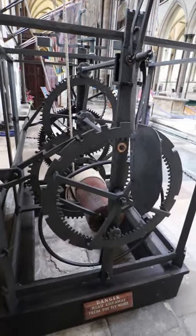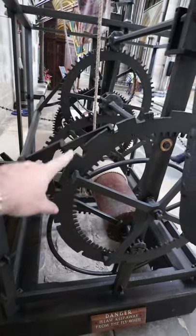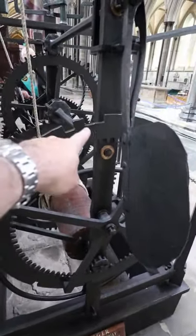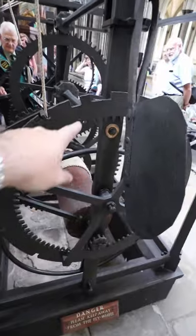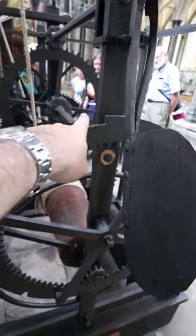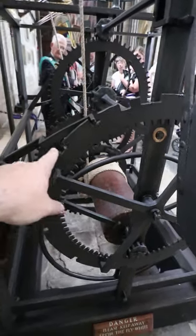When the clock would strike, this arm here would lift up when it was lifted by the pin. You can see the different-size notches that this little finger would fall into — these notches change in size. This one is really short, so it would do a very short ring, and then as it goes over the next hump it does a slightly longer ring, then a slightly longer one, and a slightly longer one, and so on.